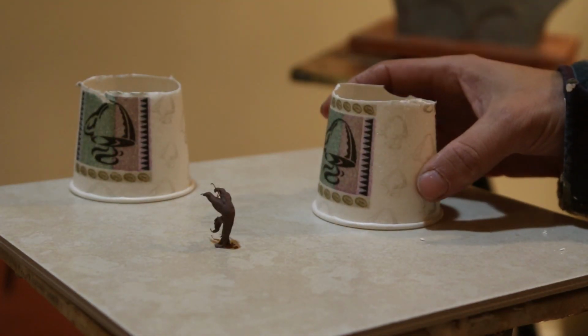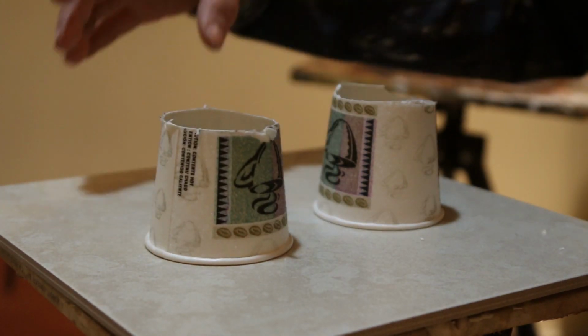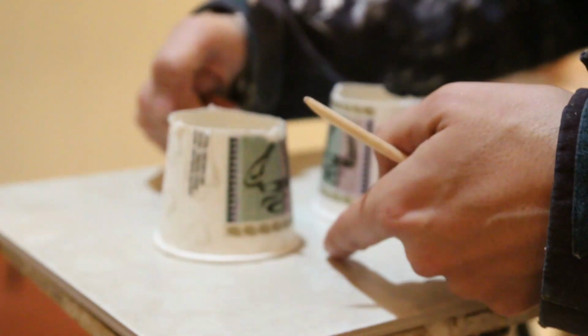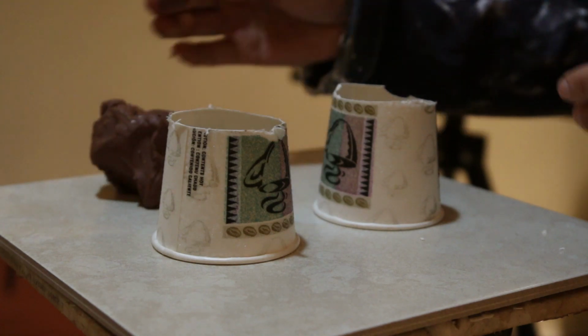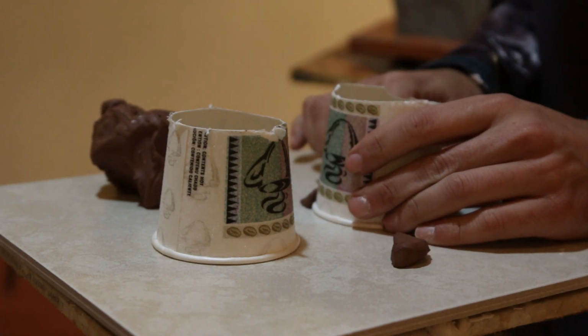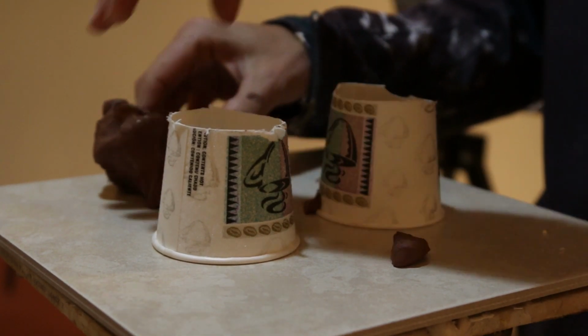this is going to be my mother mold, like that. So I'm just going to put it here. Next thing I'm going to do is put some clay around here. You could also put hot glue. For the sealing, I'm just going to be using water clay because it's cheap. And I'm just going to go around the cup on the outside.